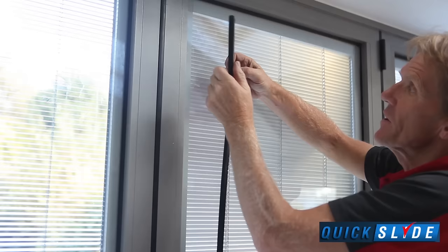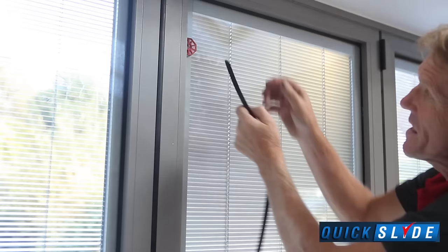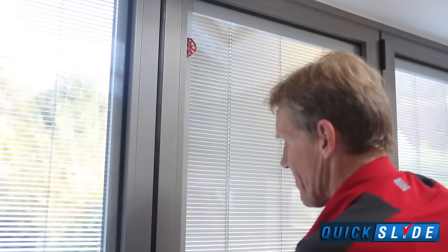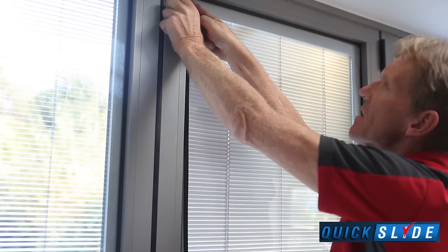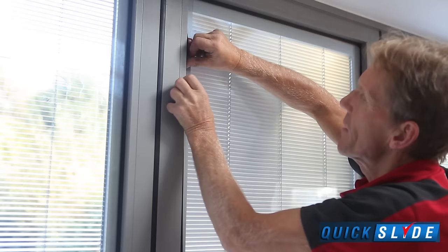And then I always use a couple of spacers. Put the spacers in just so that you're pressing the glass against the outer gasket. That little bit of compression will help you. And then you miter the corners with a pair of scissors, push the edge in, and then what we do is a little Loch Ness monster around there, a little loop, like that. Push the gasket in all the way.